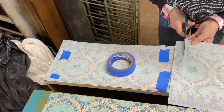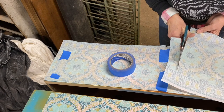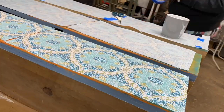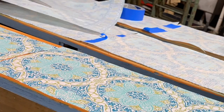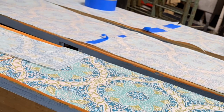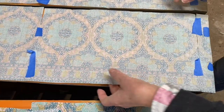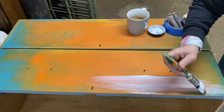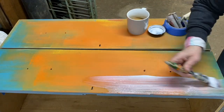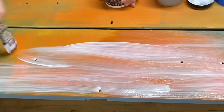I use some blue tape to hold all the pieces together. I want each pieced section of inlay to become one unit for each drawer front. It's really important to make sure you are piecing together your inlay pigment side down. Then on the end of the drawer I'm making two little hinges out of tape so I can pull back that entire piece of inlay. Then one drawer at a time I'm going to wipe on the liquid patina and apply the inlay over the wet liquid patina.